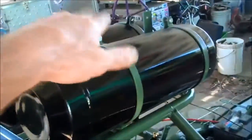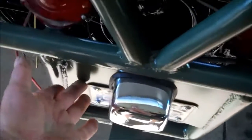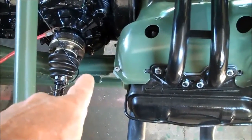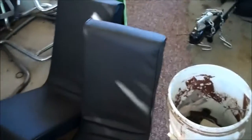This particular trike has trays that are just angle iron with a flat piece that goes in, and there's another tray up there — completely whatever design you want. You may want a nice heavy piece for your trailer hitch back here, and a little piece of sheet metal for your license plate light. A couple of pieces of angle iron down there are the lower mount for the rear cage. For two seats you need a twenty-foot stick — twelve feet for the rails and the rest for the cross members that go across.